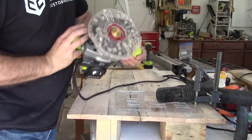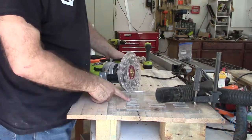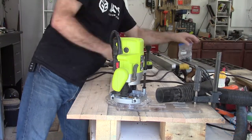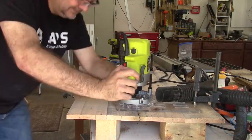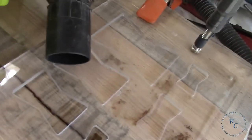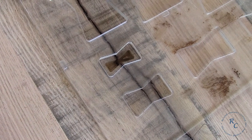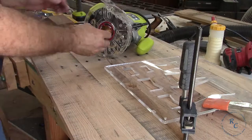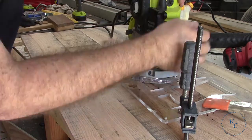Next, to address that big crack in the top, I thought I would install a couple of Dutchman repairs. This process involves following a router template and using a template inlay bit and collar set to make the cuts. Here's the location of the first Dutchman cutout. It just needs to be cleaned up a little bit and the corners squared up with a chisel.